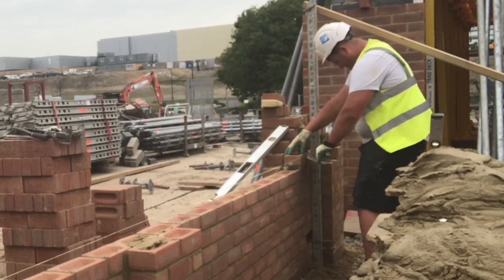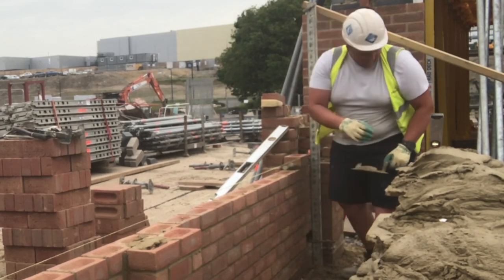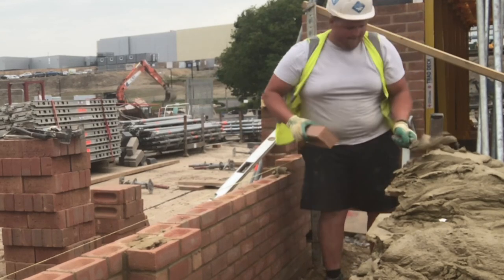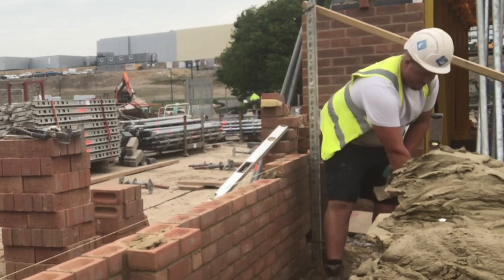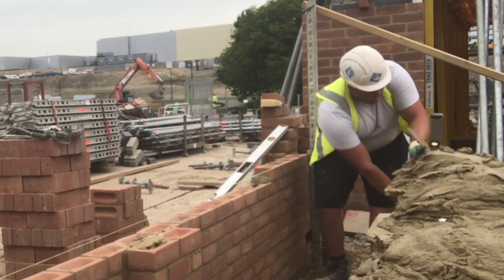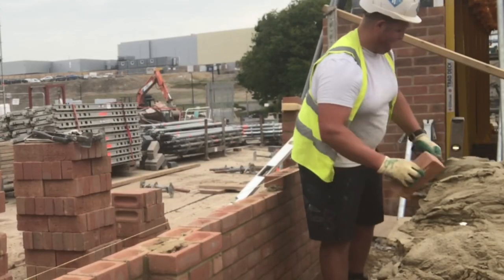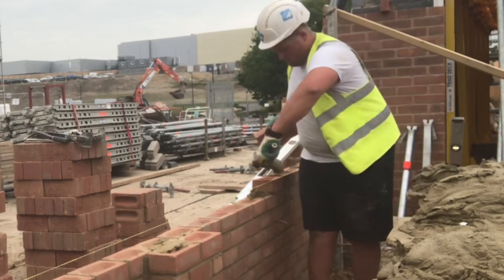Back again with another boundary wall — got a nice big stretch today. We managed to pull two panels with three pillars in at once using a new profile setup. I'm using aluminiums with an F-clamp clamped over both skins of brick at the bottom, then timber bracing at the top with a heavy block trapping the timber. It's not laterally plumb, only pulling vertically, so I've still got to put the level on all three pillars, but I'm taking away the corner aspect of building the pillar.